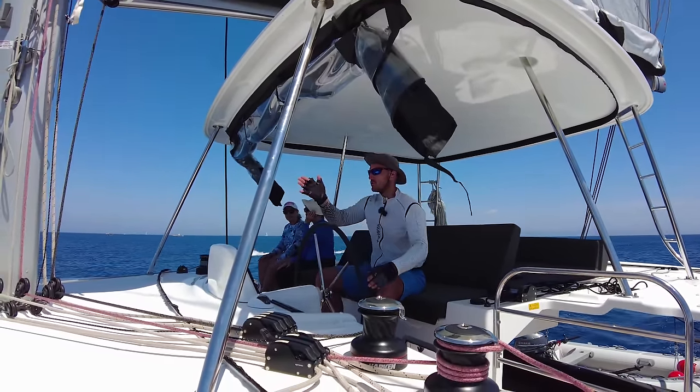We're also going to start the engines already, give a little bit of throttle. If we reduce the apparent wind speed, that means there's much less force on the sail. And if you go downwind, there's much less force to furl the Genoa. Now starting the engines first. See, we're getting pretty close, fast, to shore. So you do want to do this a little bit earlier before you hit land.